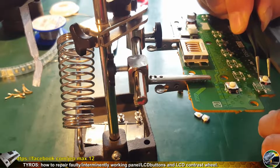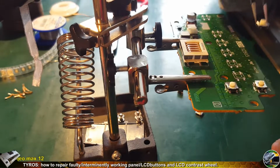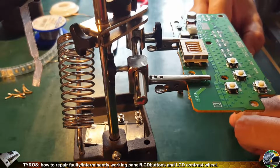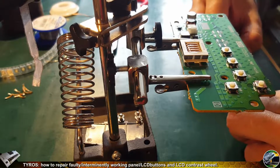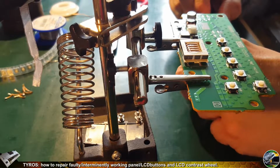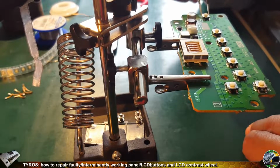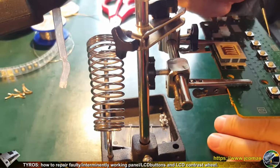So I start to put all the switches in place. As you can see on the PCB, there is a descriptive layer with white drawings indicating where your elements should be put to work. If you move them away from these drawings, elements like switches are not guaranteed to work properly. So they must be placed rather precisely before you solder them in finally. So in a second I will reposition all of the microswitches. It's just for my convenience, because it goes quicker for me if all of them are placed correctly.